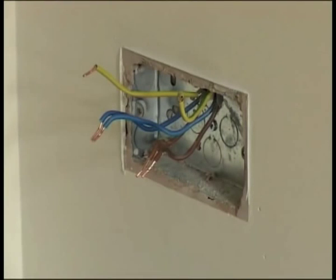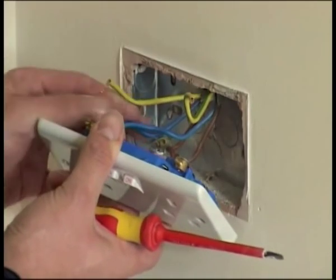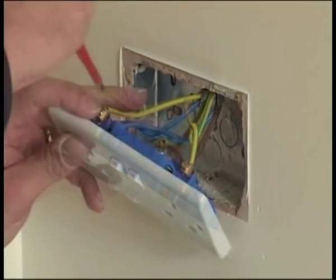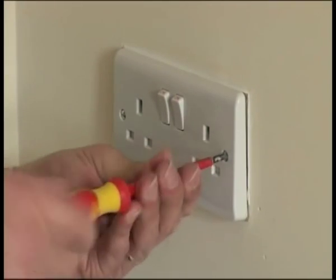This is Mark Lockley and he's from Edwards Technical. We're going to have a chat about RCD protection in the house. In terms of the 17th edition, what are the changes? How have they affected the way that you install socket outlets? The 17th edition states that all socket outlets must have an RCD-protected circuit. What's the difference from the 16th edition? In the 16th edition, it was only socket outlets that might be used for outdoor purposes, such as lawn mowers, power tools, things like that.